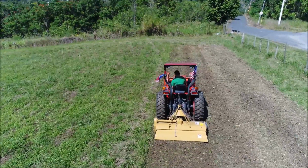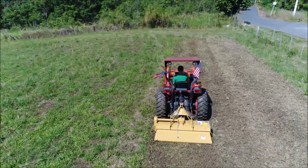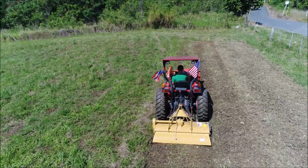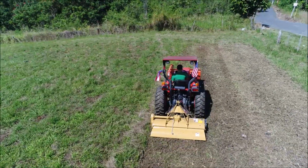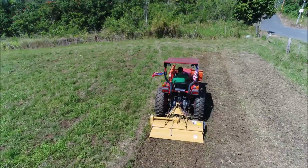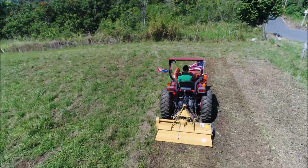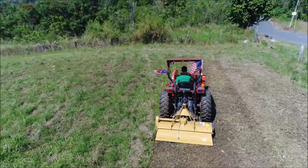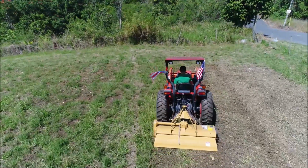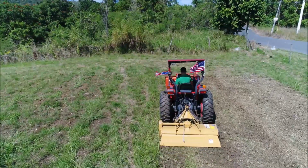And this is basically thinking from the tractor perspective. The tiller worked absolutely fine. I found out that the limitations I encountered were not due to the tiller. Instead, it was due to the power of the actual tractor. Now, this tiller is rated for a 25 horsepower up to a 45 horsepower, I believe are the ranges, and mine's a 30, so I thought it was within the expected rates, and it was, but there's a little adjustments.